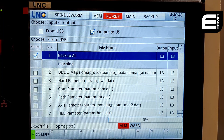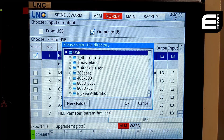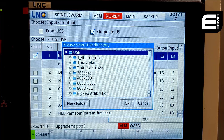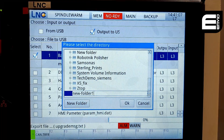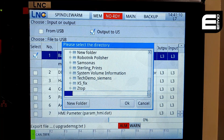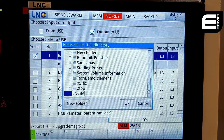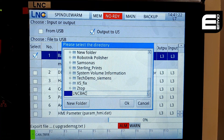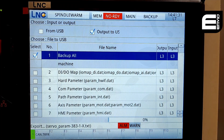It will do its own thing. The first thing it will do is mount the USB, then it will ask you where you want to save it. If we press the right-hand key on your keypad, it will open up further down and you can create a new folder. Let's create a new folder by pressing input, going to new folder, and naming it LNC backup. Press input, and then input again, and off it goes.